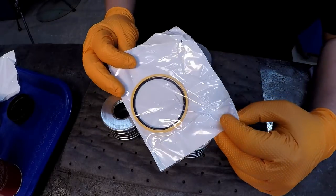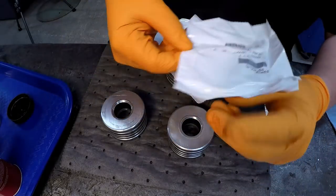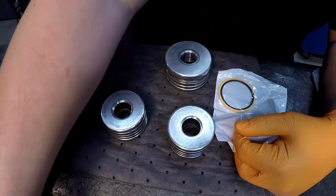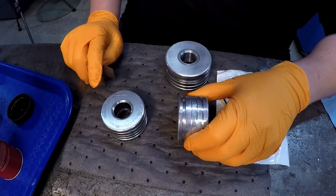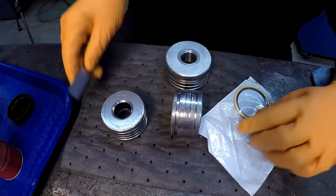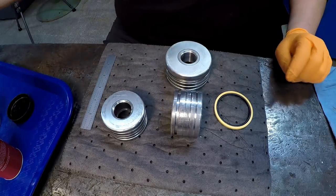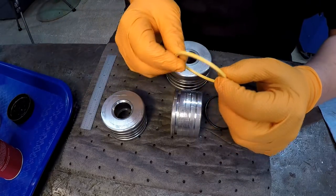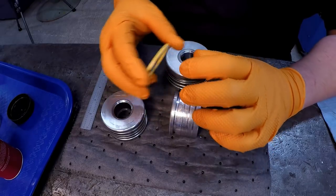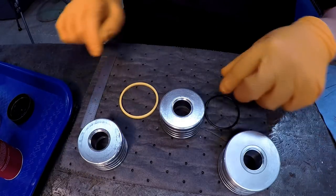Here are our pistons - got them all cleaned up. We've got our PS piston seals - PS 1448, that's going to be our two and a half inch, and then we've got the 1400-40. These are my least favorite type of piston seals but they're going to be pretty easy to install considering the groove is real close to the edge. They're excellent seals - they have a high PSI rating, I believe these are for 5000 PSI. This material expands and it's very difficult for it to fully contract - it's not like Buna or nylon. Once it stretches, it takes a while to come back to size.